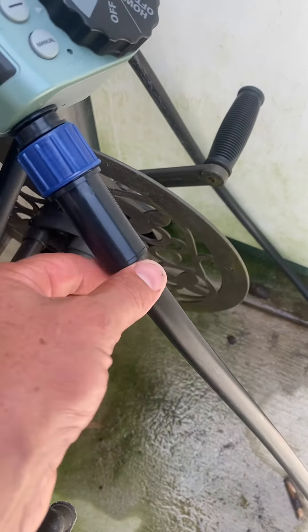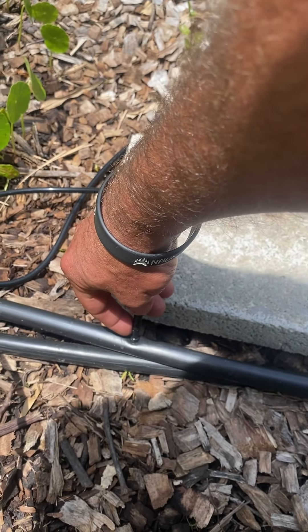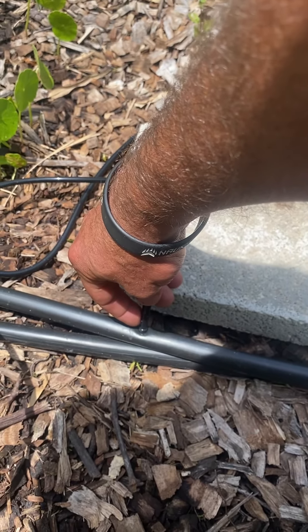You get this little thin hose and I get all of this on Amazon. This older one is a harder plastic — I do not like these nearly as much. The newer ones are squishy and rubbery; they are a lot easier to work with. You get these little spike attachments — I'll try to put all the Amazon links in the video notes. The spikes have a spike on each end: you press your hose over one end, pop a hole in the main hose, force the other end in and it clicks in there with a pretty good seal. And then the last piece you need is this little drip emitter, which is where the water drips out. You can screw it up or down to determine how much water comes out when the system kicks on.